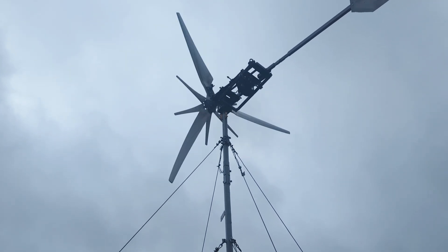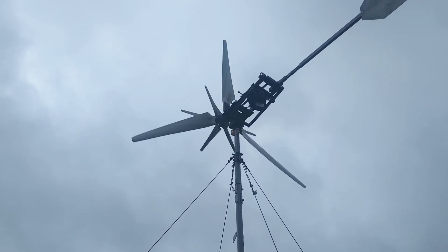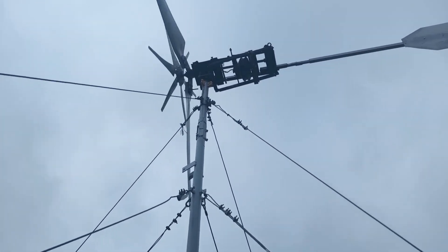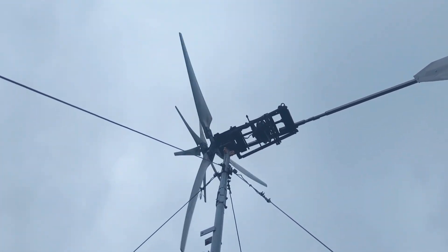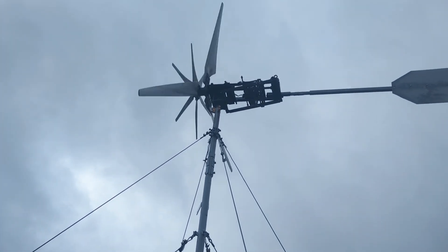Good day friends, it's Wednesday and I'm feeling quite good about this. I've stuck the second set of blades on and also changed the gear over to the larger one, so we are getting a good overdrive. It's about 12 to 13 mile an hour winds but it seems to be running very well considering it's in the high gear — the motor is travelling 1.6 times faster than the blades.